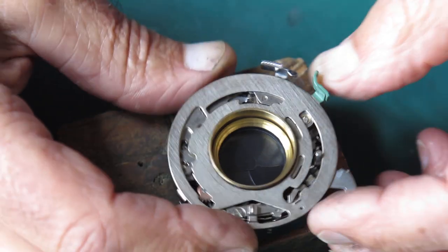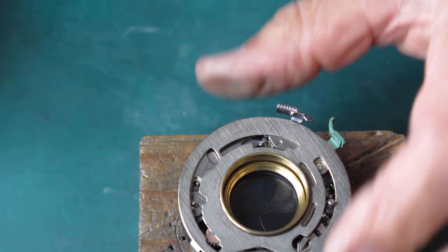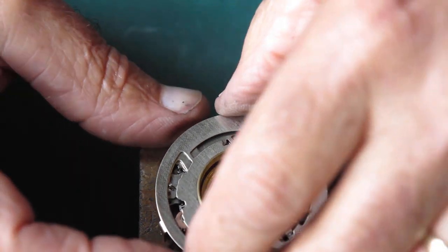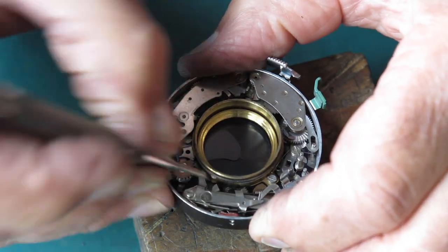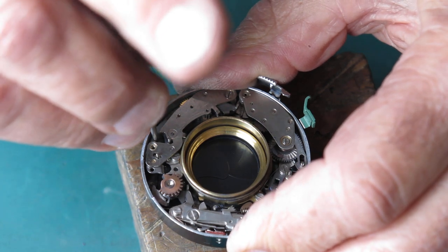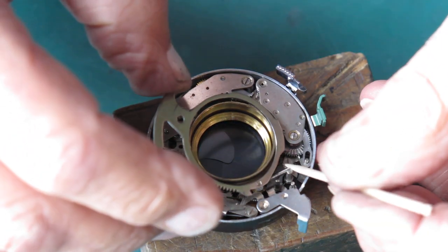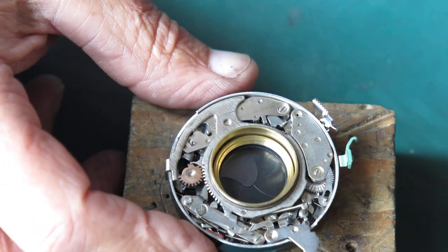Get that round to the eighth position — that sounded more credible but it was still too quick. We're in the ballpark; it was probably closer to 1/15th, which is ridiculously quick. The one-second is quick too. I'll lift that off, cock the shutter, and move the retard gear train in again — just a little bit more. These adjustments are pretty subtle; you can spend a long time going backwards and forwards trying to get the balance right between too fast and too slow.